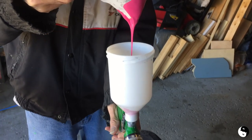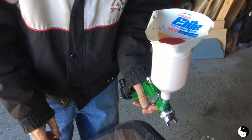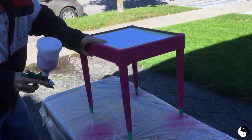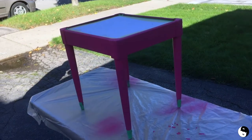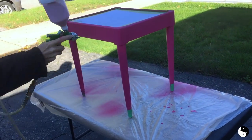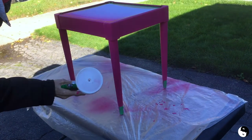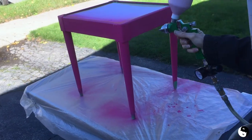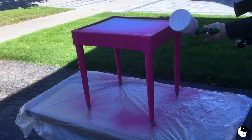It's streaming through really well, so that means it'll be fine for the paint gun to spray. First, lean the chair forward so you can get the inside of the legs. Then flip it around and do exactly the same thing to the two opposite inside legs. Once that's done, start to go around each leg, then come up and do the rim of the chair — make sure you get the top — and continue spraying the next leg. Keep your wrist straight as you spray; it's all in the arm motion. That way you get nice, even coverage.